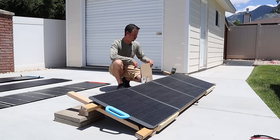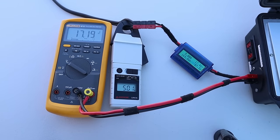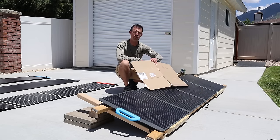Now with the PV200, we're going to put on the piece of cardboard to see how it does with partial shading. For partial shading, we're getting about half power: 17.8 volts, 4.9 amps, 87 watts. The PV200 is also wired together in parallel, so it has really good partial shading results. Let's move on to the next panel.